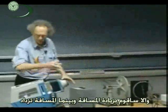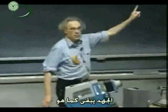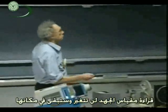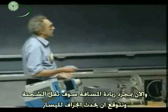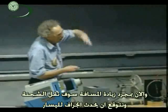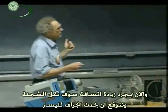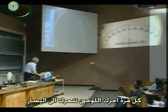And now I'm going to open up. As I'm going to open up, the potential remains the same. So this voltmeter doesn't give a damn. It will stay exactly where it is because 1500 volts remains 1500 volts. But as we open up, we're going to take charge off the plates. And so this I expect to go to the left. Every time that I give it the little jerk — I do it now — it went to the left.